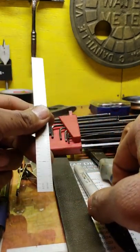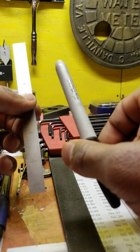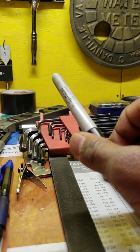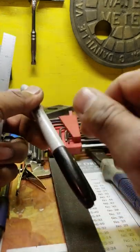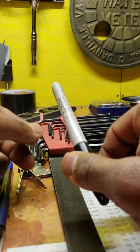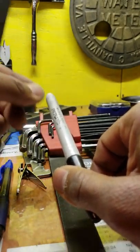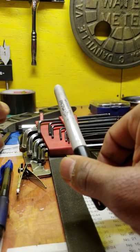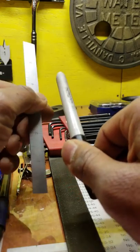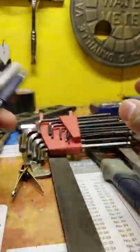Along with your six-inch scale, I'd recommend new guys have a permanent marker. A lot of guys borrow my markers all the time. You can use them for marking chuck jaws, numbering them one through four, and you can write on your mill or lathe. If your boss comes up and says change a dimension, you can write it right there while you're working. Permanent markers come off with WD-40 or coolant — no problem. Also keep a pen in your shirt pocket. It saves time and makes you look prepared.